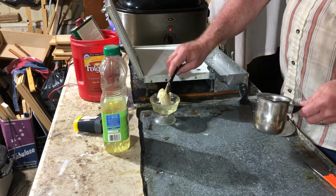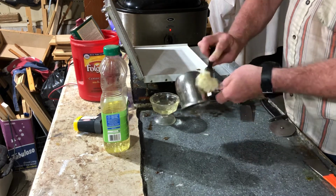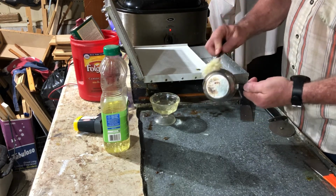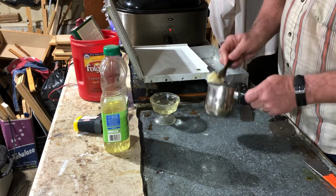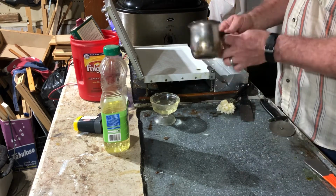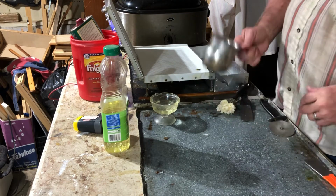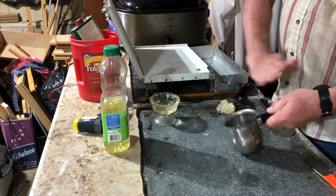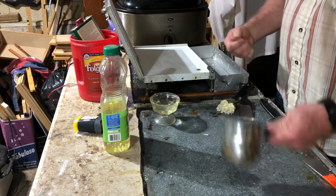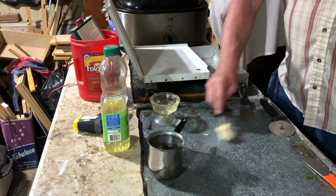So the trick is that we're going to use the cup to pour up the wax, but we don't want it sticking to the metal. That can be a problem, because then we've got to either use a torch to melt it off. That's harder. But what I've learned to do is to wipe up the cup with canola oil really good. I'll get about 5 or 6 pours, because it will build up on the outside and the inside of the cup until I just have a little bit of room for wax. I'll take the air, cool it down, I'll slice off the top, and the wax will constrict with the cooler air, and I'll be able to slip those 2 pieces of wax out of that cup. That's pretty clever to watch done. That's pretty cool. I'll take some canola oil and wipe my tray.